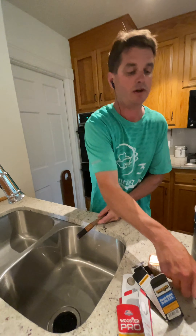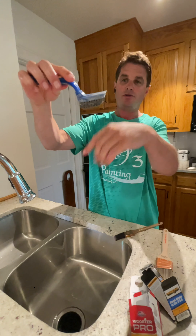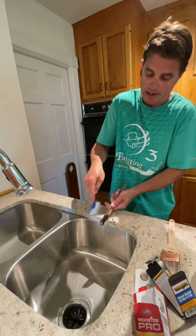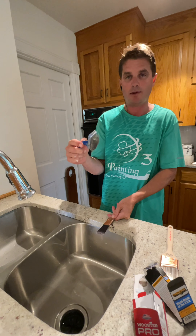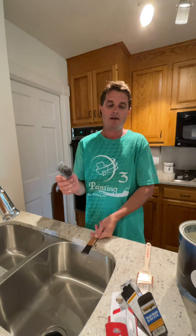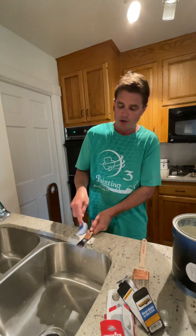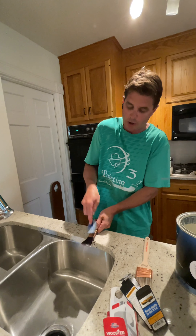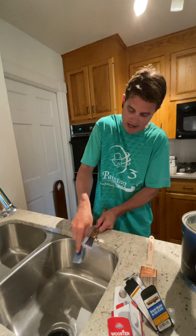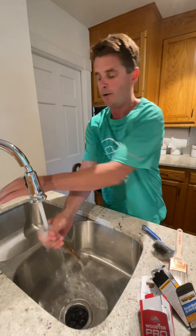This is a stainless steel stripping brush — it's a few years old and you can see how the steel bristles have tilted back at a 45-degree angle from cleaning strokes going down. This is the best tool to use to clean up a paintbrush. I know they sell those brush cleaners that look like a comb — those don't work well for regular cleanup; they're only good if there's dried paint all over the brush. Whenever you clean up, just use this stainless steel brush: go straight down, not too hard, right where the stock meets the bristles, into the sink.